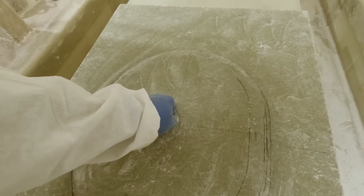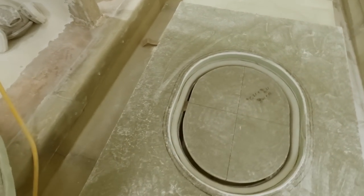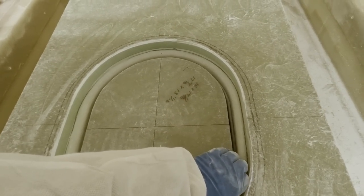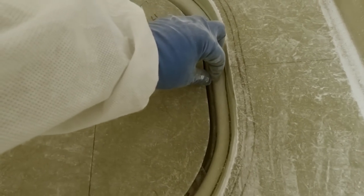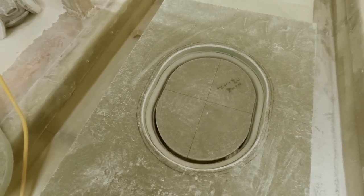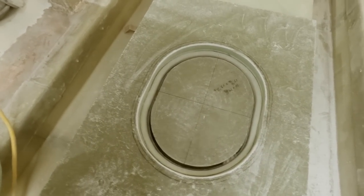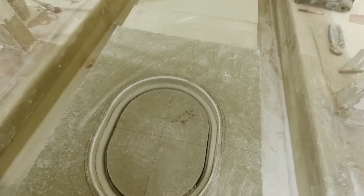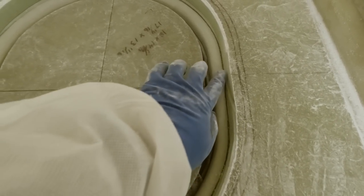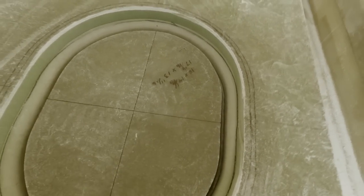And if I remove this, you'll kind of see what I'm talking about. So this is the second layer right here, and this is trimmed now. By the time this surface gets glassed, and also this surface gets glassed, it'll almost completely close that gap. There should be roughly an eighth of an inch, maybe a hair or less in between there. And that's gonna be just about right. This is gonna get cut back right here and opened up, and that'll increase the distance on this flange, and this will also get covered with glass, which is gonna make it come out further.